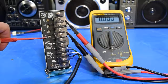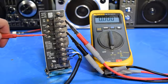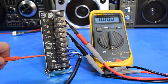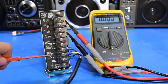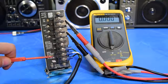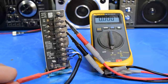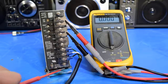It's also got an overvoltage adjustment here to protect the power supply from supplying too much voltage. Right here on the front panel are some of the overall ratings of the unit. The input rating is 90 to 130 volts AC, 47 to 440 hertz, or 115 to 165 volts DC. It is UL tested and approved, and down here it says NEMIC Lambda, made in Japan.